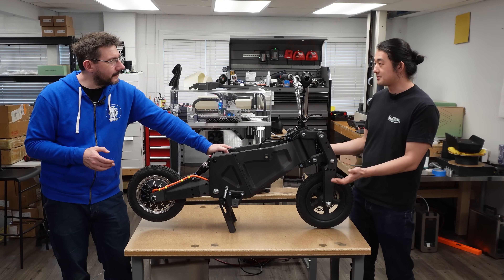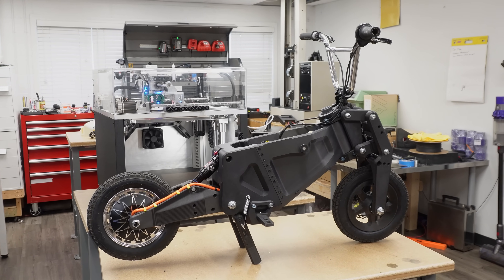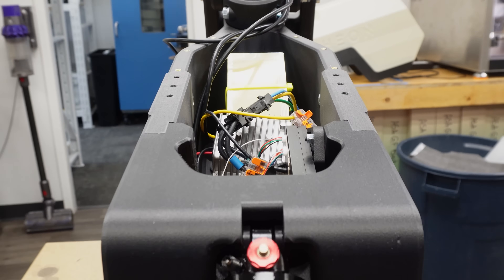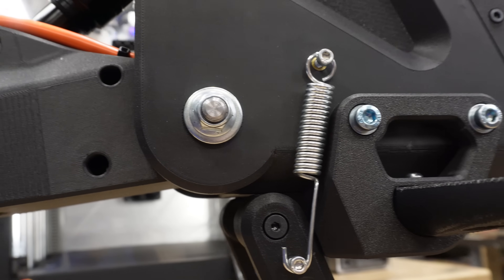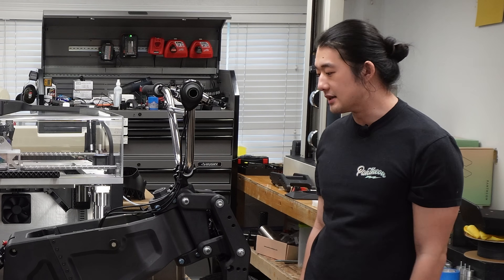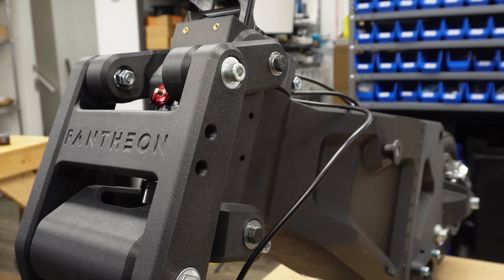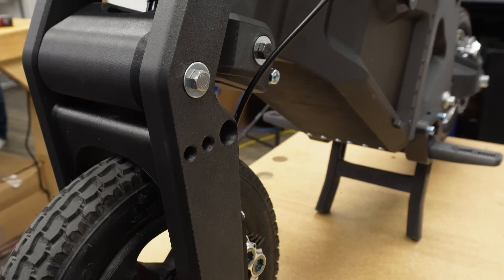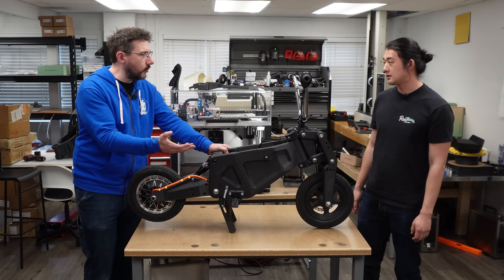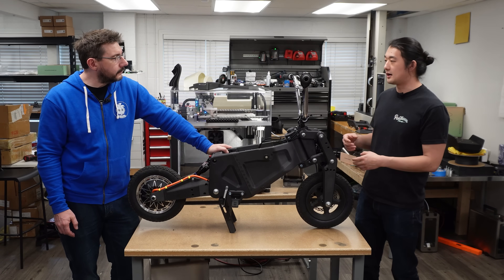I kind of have to live what I'm selling. This is my favorite 3D print in the world right now — it's a 420mm long part, about two and a half kilos of carbon reinforced nylon, and it's completely dense. There's no infill in most of this, which makes the surface finish much more challenging. To make something like this traditionally, you'd be looking at billet aluminum die casting or pan-welding a steel perimeter frame. Or you could just 3D print it. I designed this in essentially a weekend blitz and it printed in one week on the HS Pro. I love riding motorcycles, and we've been testing 3D printed parts on motorcycles for ages — air boxes, air intakes, headlamps, and now handlebars.